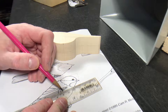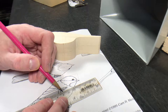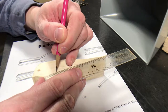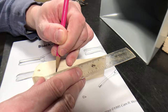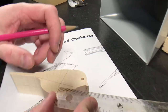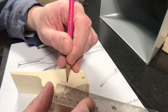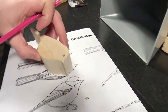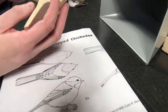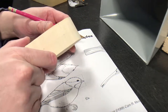My story is a summer bird, so he's going to have his wrist probably on the outside. It doesn't hurt to know roughly where that curl-up begins. Measuring along the line we've already drawn — it looks like about 20 millimeters — we'll just start curling it up right about there. At this point it doesn't have to be exact; it's an estimate. I just want to know roughly where to preserve the wing. The wing will be preserved right about there. It's not going to be critical in the roughing out but it can help orientate me when I'm carving away wood.